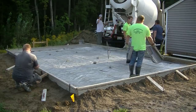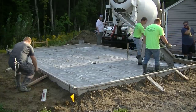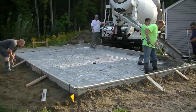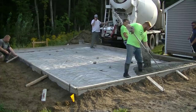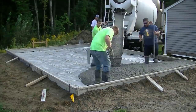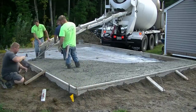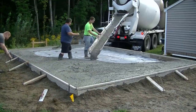It was supposed to be a six inch slab. When we showed up and had it all formed up and set to grade, the building manager came out and said code enforcement requires this to be an eight inch thick slab, and we have to match the top of that floor over there. The builder that hired us only told us six inches, that's why we brought two by sixes and I only priced it as a six inch slab. We can make it eight inches — no problem — we just add on to the top of the two by sixes, which is what you see right there. He'll just have to pay for the extra two inches of concrete.